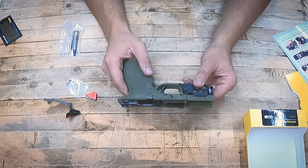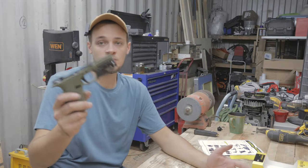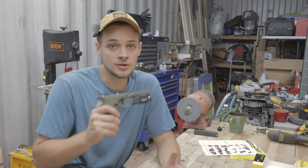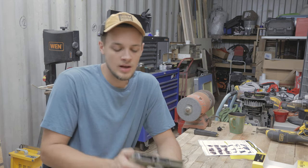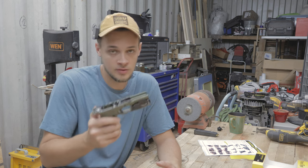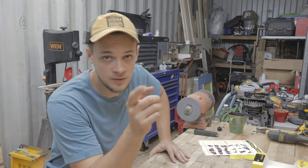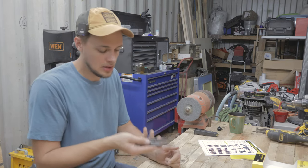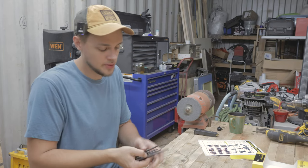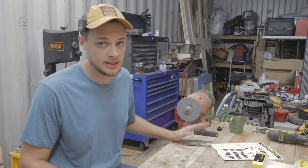To begin the actual assembly we first need to remove the stock components, which means we've got to remove these pins. If you guys have any experience with daggers, I'm going to confirm the rumors — it is true, these pins are extremely difficult to get out. They're not at all like the Gen 3 Glocks where you can just push them out with a punch. Every single time I've had this open, I've had to use a hammer. I've grabbed my punch set — I'll provide a link in the description. If you're going to do any firearms work, I highly recommend getting a dedicated set.